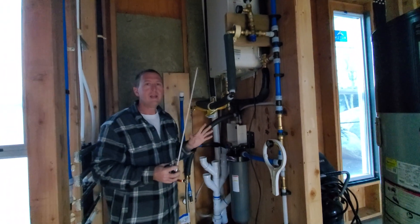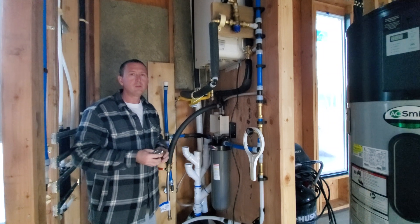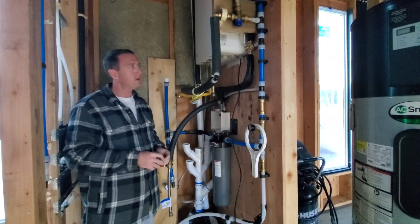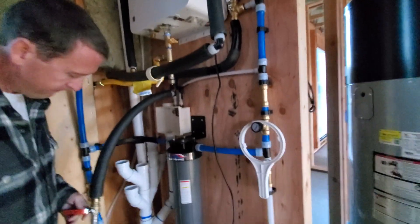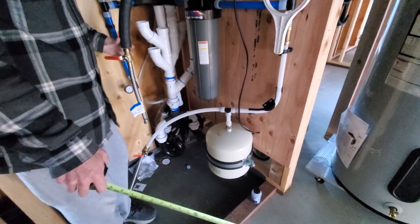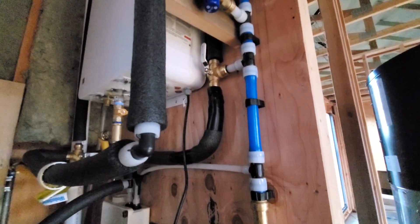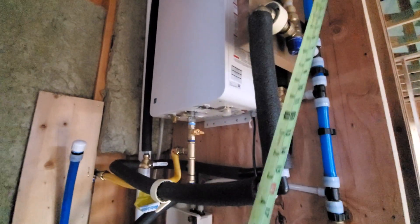If you have two water heaters, they can be redundant for each other. Say the tank water heater is broken or not installed — you would close the two tank valves, take the tank out, and go fix it. While you're waiting, cold water will still come through here, go up through the three-way valve, make its way through the tankless as described, come back down, and follow the same route out through the house.